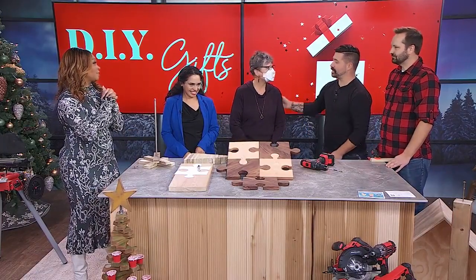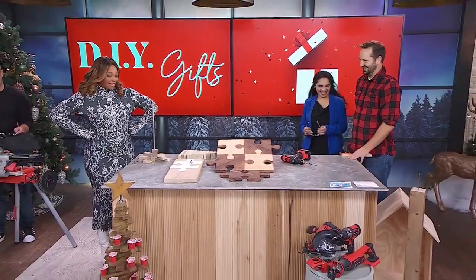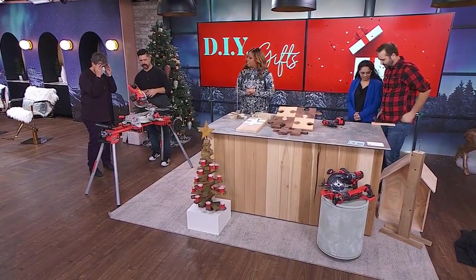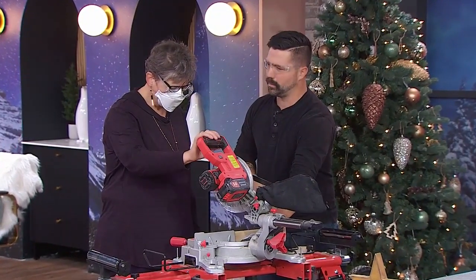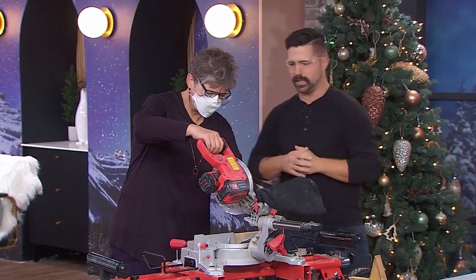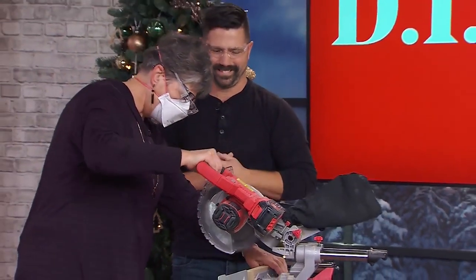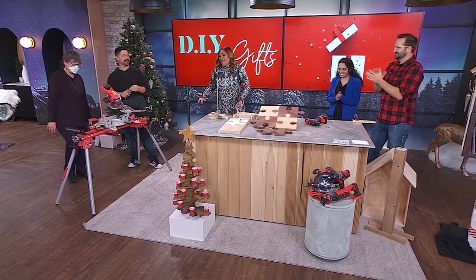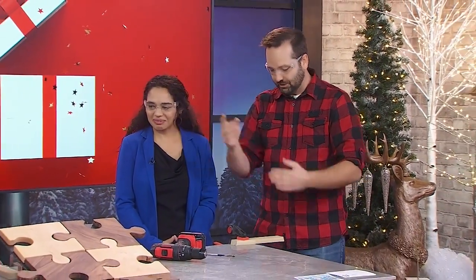Joey, come over with me to the chop saw, and you'll be over here with Dave. Make sure you've got your safety glasses on. Have you used one of these before? — Oh yeah. So your main note: start the saw off the wood, go down nice and slow and easy. There's also a little guard here — flip that to the side and go for it. She's a pro! Easy peasy. We'll pass it down to the trim team.